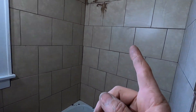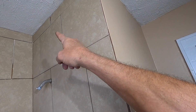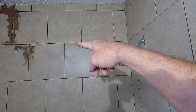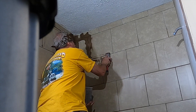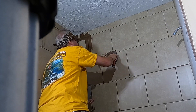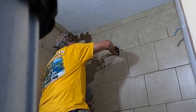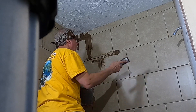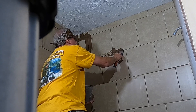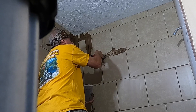I've got all of that grouted. I just lined up the top row up here. All it is to grouting is just making sure you fill that channel up really good and get it pushed in, and then smooth it off with a little rubber-type trowel. Not really much to it — just make sure you get plenty in there to fill it up.